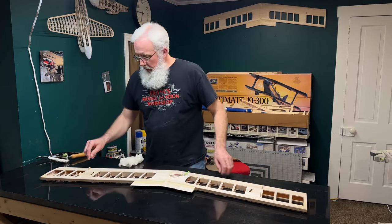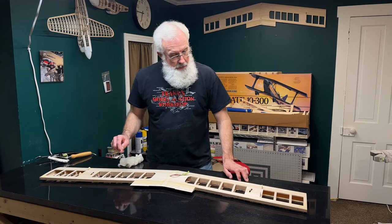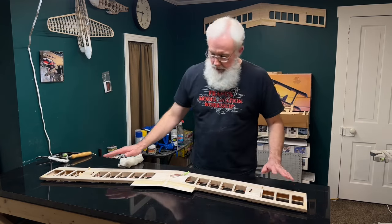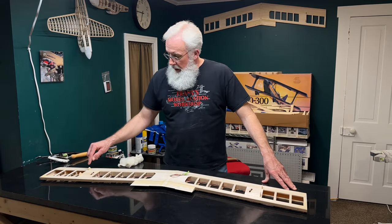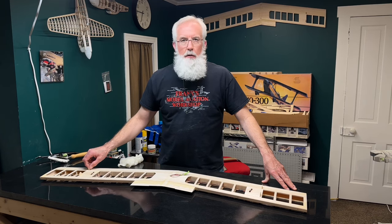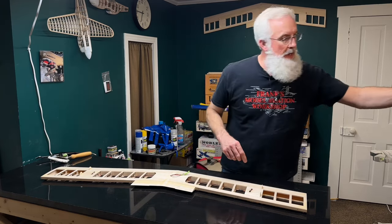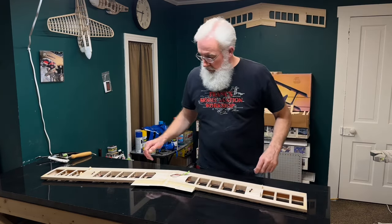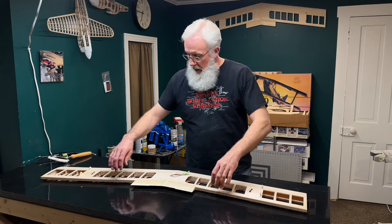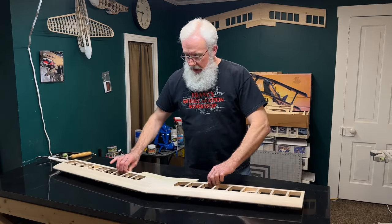And you're probably wondering, what about the tabs? Are you going to paint them? And yes. First thing I'm going to do, though, I'm going to cover it. And we're going to mask off. We're going to paint it with some thinned out resin to seal the grain of the wood. And then after that dries, we will spray it with some deep blue Rust-Oleum. So that's it. It's tacked.